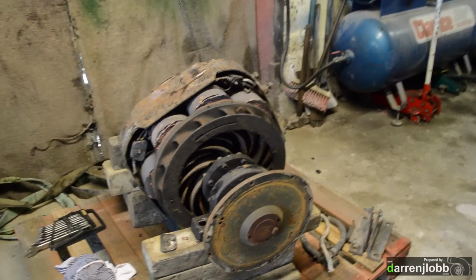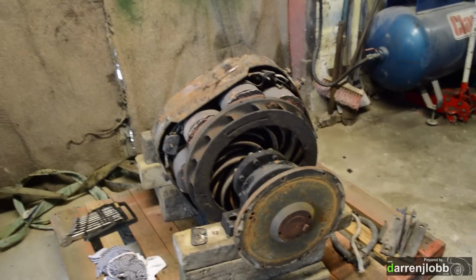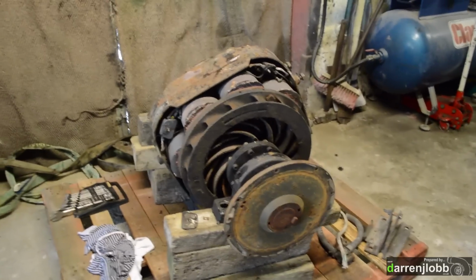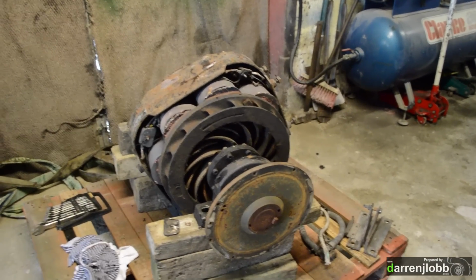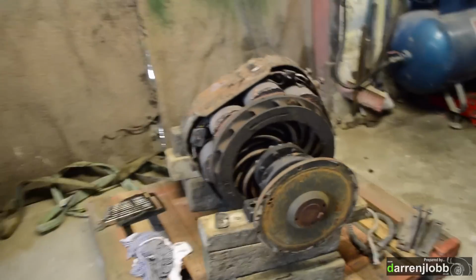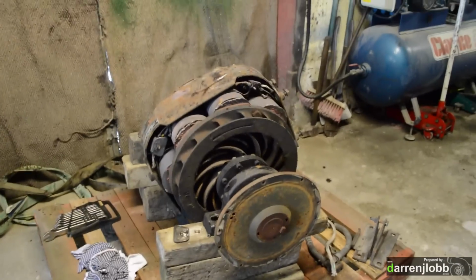It's completely electrical, there's no water involved or anything like that, so a lot more reliable. And also the key advantage is it responds almost immediately to input. Obviously this is because it's just electrically controlled, it's nothing more complicated than altering the input voltage, which can be done by the computer, and the brake will respond very quickly. That therefore means you can do power runs and load testing without having to interfere with it at all. The computer will do 100% of the work.